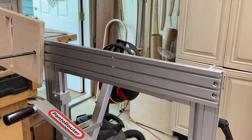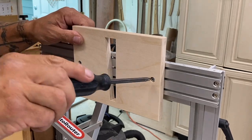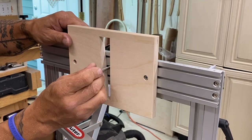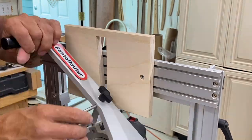So we can slip this in place — just loosely for now. We're cutting those angled dados one at a time, but there's a left and a right. So to ensure accuracy, we'll use a stylus in that center hole to locate the straight side of the shop-made template.